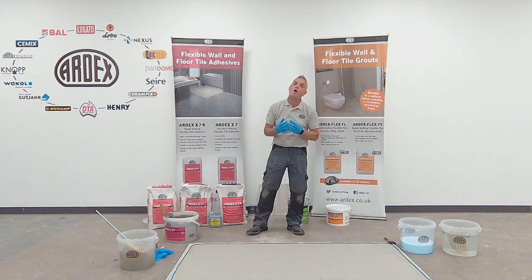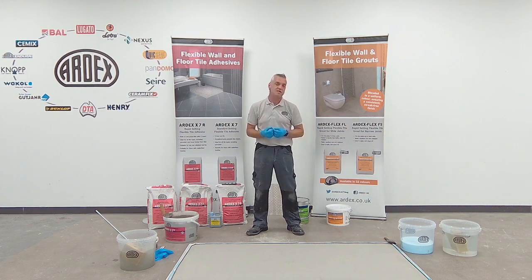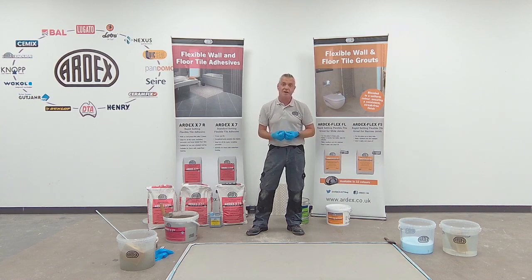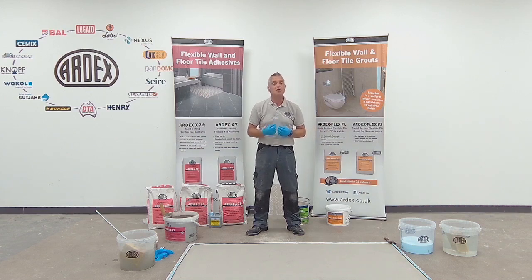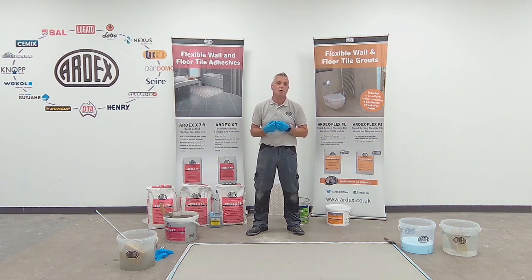So starting things off, as far as tiling in hot conditions, what is this actually affecting? With regards to tiling in hot temperatures, you need to be looking at anything over 20 degrees C, which is the optimum for all the products. So when we talk about pot life, this is based at 20 degrees C. When you start increasing that temperature higher, to the likes of 25, this can start to have a knock-on effect on performance, meaning the product itself won't achieve its full strength. As it gets hotter and hotter, it can also reduce your pot life and open time. So it has a knock-on effect on your working conditions.